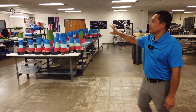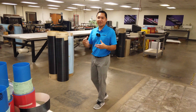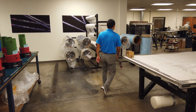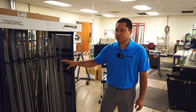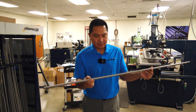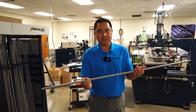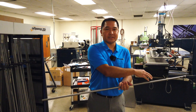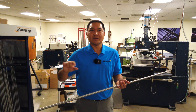All this stuff you're seeing right here is actually vaulting poles — we really specialize in making carbon tubes, so anything that is a tube structure we can make, like arrows, vaulting poles, cue sticks, and stuff like that. This is really where it starts: the mandrel. The engineer will come up with the design. This isn't a golf shaft per se, but it's a basic parallel tube — same concept. We have a steel mandrel that dictates how stiff the shaft will be in terms of butt, mid, and tip, which determines whether it's R-flex or S-flex.